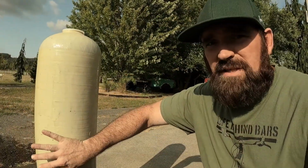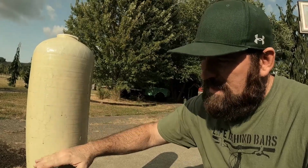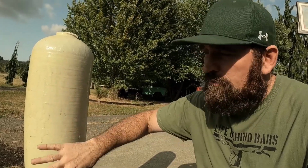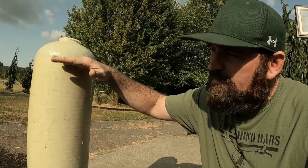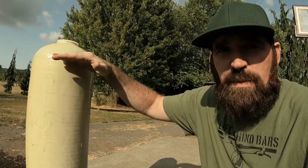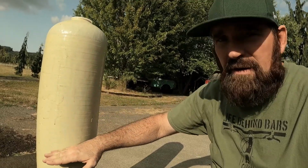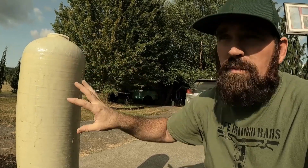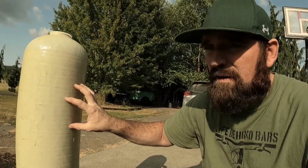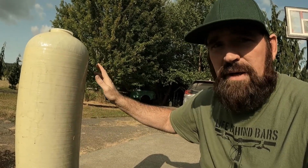It's kind of a blessing in disguise, because one thing I found when I was draining the water out of this is our media level is actually down here less than half. Now when you replace this media, you want to go about 2/3 of the way full. I think they said you want about 15 to 18 inches worth of headspace up on top. So the media should really come to about here. Well, right now our media is way down here, less than half. So something inside that controller was leaking. I'm guessing probably the backwash, since that's where the cycle got stuck on. So in that backwash, it was actually pulling the media and sending it out to the drain out to the back.